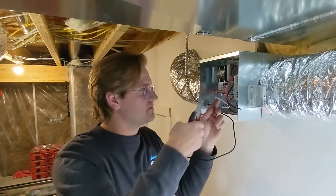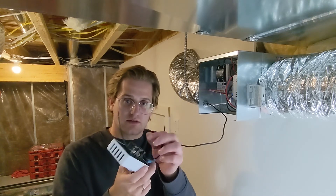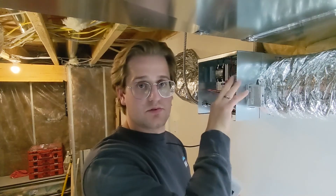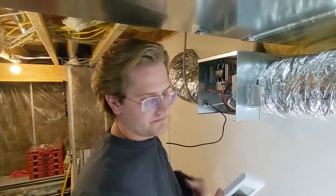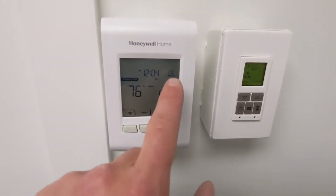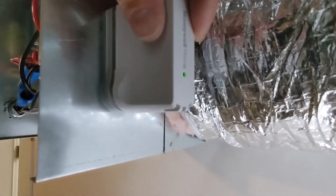I didn't quite finish last night — ran into a bit of an issue. I originally picked up a line-voltage thermostat, meaning the actual line voltage passes right through it, but foolishly I ran 18-gauge low-voltage wiring. So I found this really fancy wireless line-voltage thermostat. There's a little relay mounted inside the box with an antenna that communicates with the thermostat — it's programmable so I can mount it in the shop and don't need to come up here to change the temperature. Let's see if this thing works. The heat's on — looks like we're getting something on the heating element. There's the relay I just purchased. I'll put the wireless antenna in and put the cover on and we'll be done. Got myself a shop and it is more or less complete. Thanks for joining this episode, see you in the next one.